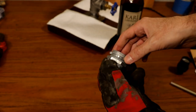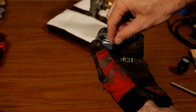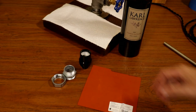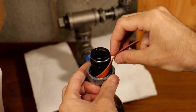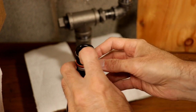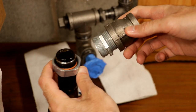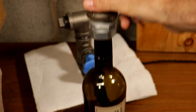This is a compression fitting meant to be used with electrical conduit. This piece I'm unscrewing isn't necessary; the other three pieces I'm keeping. Now, this piece here compresses — hence the name compression fitting — however, it will not compress enough to hold the neck of a wine bottle. I'm using a strip of 1/16th of an inch rubber to create a homemade gasket of sorts. When the compression fitting is threaded back together, the rubber will help the fitting hold the bottle without using any annoyingly sticky substance such as glue or epoxy. Just be sure to tighten the compression fitting back together tightly, otherwise there is a chance the bottle will slip out over time.